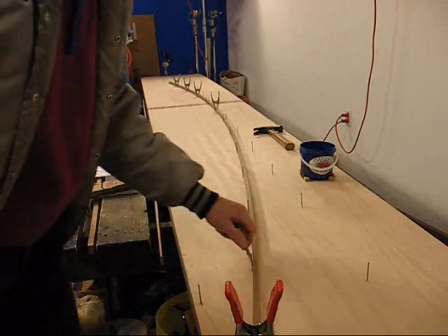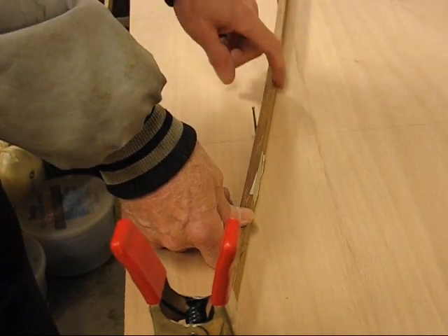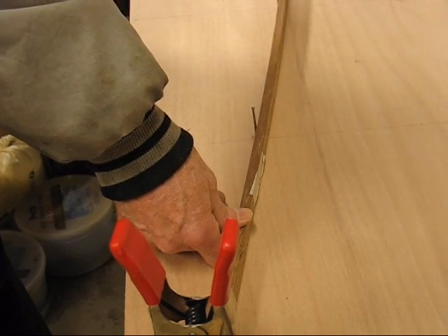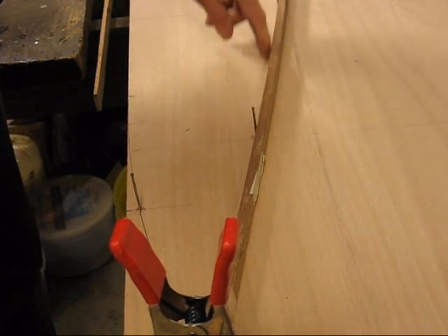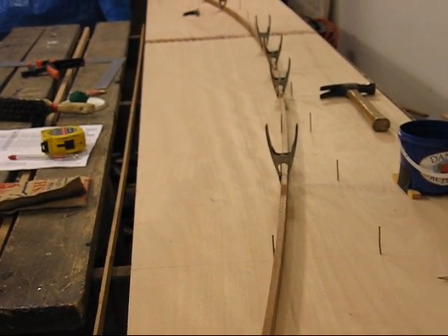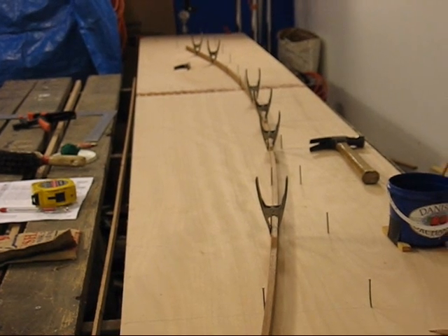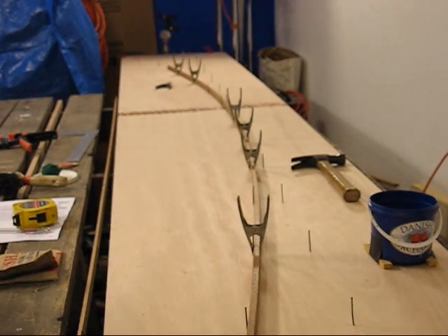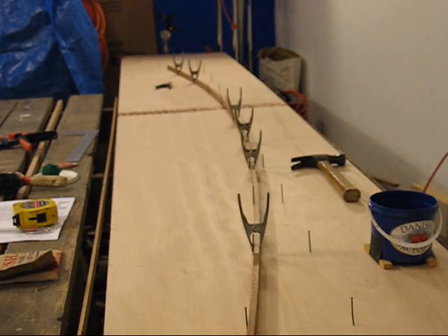Pull the batten out and take a look at our line and see how it looks. I'm pretty happy with it. I decided I'd flip the batten over and use the side that had been mill-planed as opposed to the cut face, and I put a couple clamps on where it had been off. I think I was more off on the cut face not being absolutely straight. This fits really nice now. I'll go ahead and permanently mark in that line down to about where the finger joints are, then set up again and loft in behind, because the arc is probably not correct from the finger joints on.